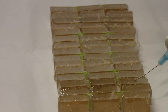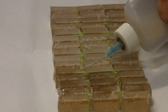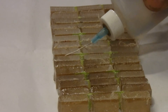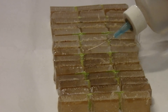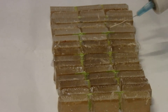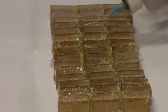I put the pieces on typing paper, which is a great thing to do when you're working with acrylic — you don't want to put it on colored paper on a dirty workbench. Get a nice clean piece of typing paper and put your piece on it so if a little solvent gets under it, no big deal. I'm going to flip them over and do the same thing to the other side. This is way more pieces than I need — I only need 30 pieces. If there's any that are particularly wide, crooked, or don't have enough surface variation, I can deselect them and just work with the ones I want.